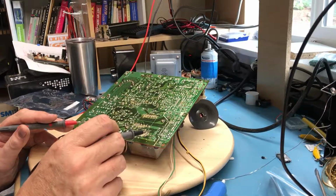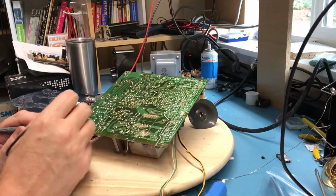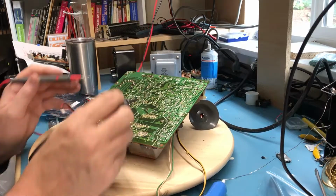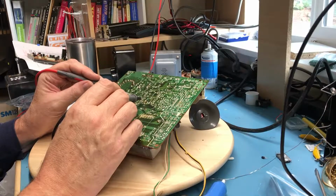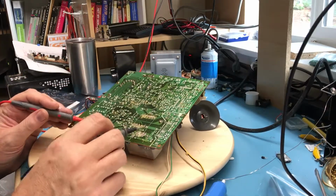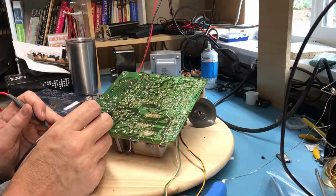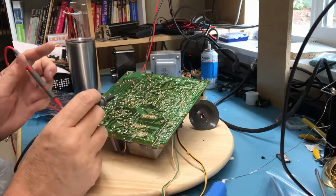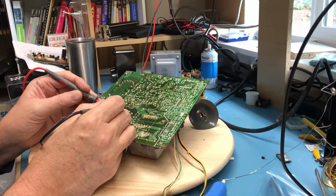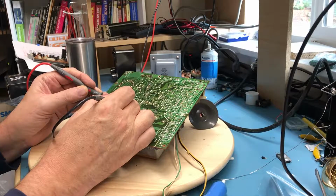There's not much left here this could be. And looking at this, we've checked the diodes on the power supply side here, on the switching side. Gone through them several times. We'll probably dive into all the semiconductors over here and just take a squiz around and see if I've got a failed diode, etc. Still, I would expect this side of the supply to come up and at least oscillate. There is, over here, this T501, which is a transformer, obviously. It has got a primary here. It measures out at about 1 ohm, and there's a secondary over here, which measures at about 0.28 ohms.